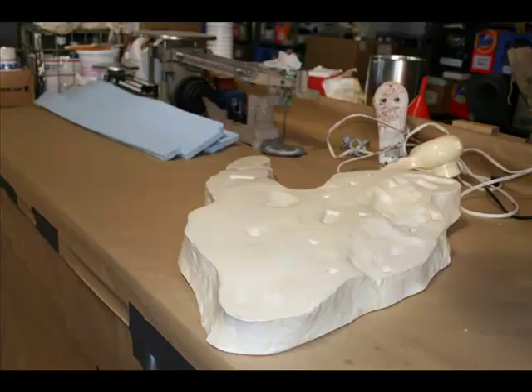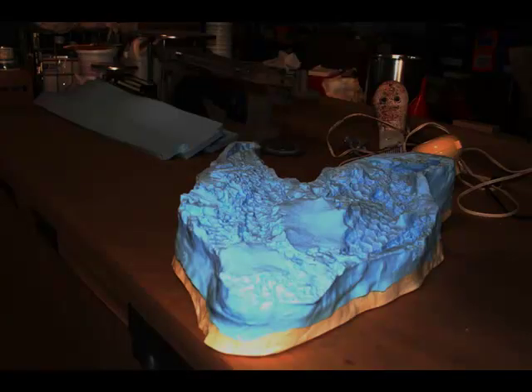This is the mother mold that goes under that registration coat, and you'll notice several registration depressions to very accurately locate the registration part of the mold when it's placed on the mother mold. I had to Photoshop some of these images just to bring out the particular features I was after. But you can see the impression coat — the rubber draped over the mother mold.